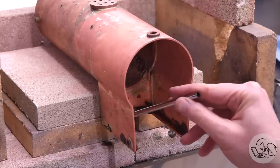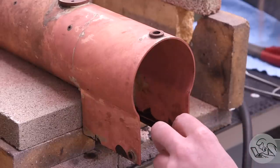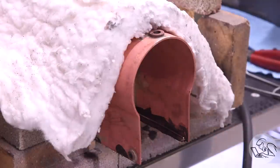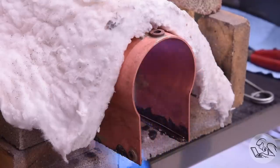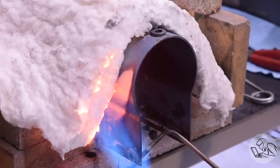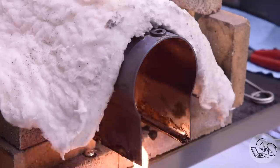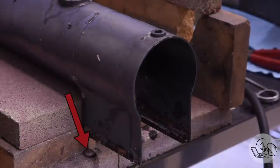I'm also installing that little shim at this stage and fluxing it — fortunately it's a nice press fit in that joint so it should hold itself in place. The way Kozo has you do this joint is in this orientation here, and he always has good reasons for why he tells you to do things certain ways, so I'm not going to deviate from it — although I do slightly regret this in a minute as you'll see. I positioned my solder and decided to cover the top of the boiler with some insulation. This is something I often do when the joints are getting big like this, because it helps get the joint hotter faster and makes it harder for the boiler to shed heat at the far end. That works well in principle and I've had good luck with it in the past, but as you'll see in a minute I think this was a mistake. I did get all the solder to flow nicely on the foundation ring — I'm heating from below, which is what Kozo recommends for this joint.